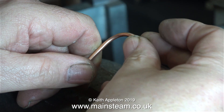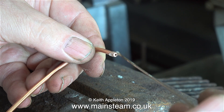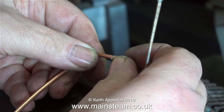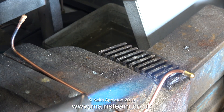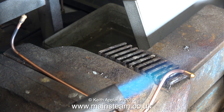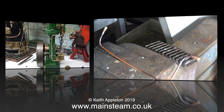All I need to do now is connect the outlet from the pump to the inlet to the check valve. I've bent a piece of 1/8th of an inch diameter copper tubing to fit between the two valves. In this part of the video I'm in the outside part of the workshop, and I'm about to silver solder a union cone onto the end of the pipe — not forgetting to fit the union nuts onto the pipe first. Both nuts are on the pipe the correct way round. As usual I'm using Silverflow 55 silver solder wire and Easyflow number 2 silver solder flux. Once the job is done and the pipe's been cleaned up, it's fitted to the engine and looks like this.